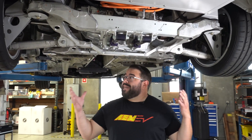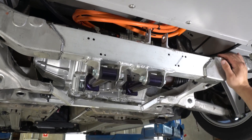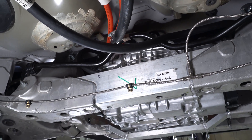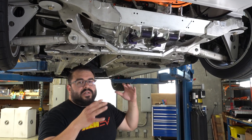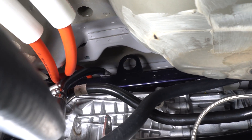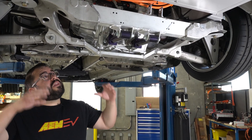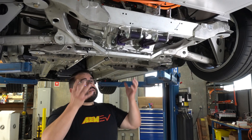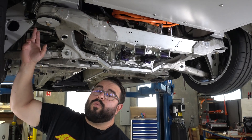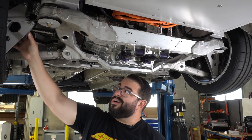The main part of adapting the independent rear suspension was getting the Tesla subframe into the car. We had some really nice mounts made up — they attach to the stock mounting points of the Tesla subframe. The Illuminator mounts in a unique fashion. At the very top, across the arches of the subframe, is a big bar with some bushings on the end that we fabricated, which holds the drive unit up, with torque bars going to the rear cross member.